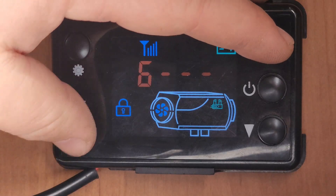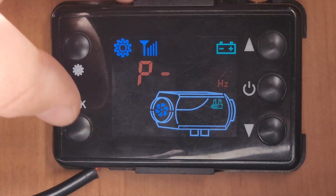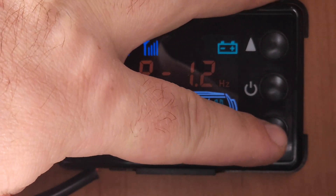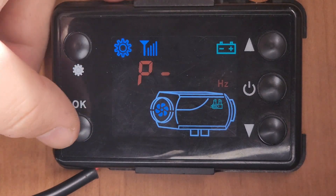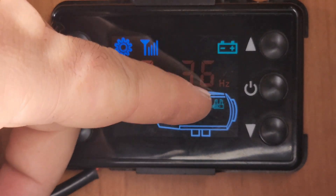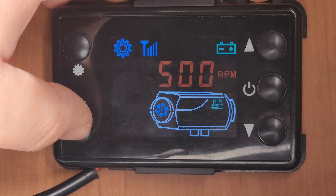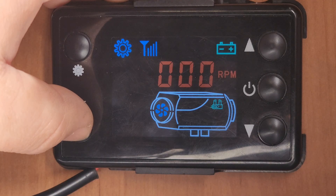So all we have to do next time is go up, OK, up, OK, up, OK, up — and that's it. Now, I'm pretty sure the minimum you can run this at is 1.2, so I'll put this at 1.6 again for a sec, and the maximum will be set at whatever you've got it at currently. My suggestion is put your minimum fan speed at 2500 RPM and your maximum fan speed at 5000 RPM.